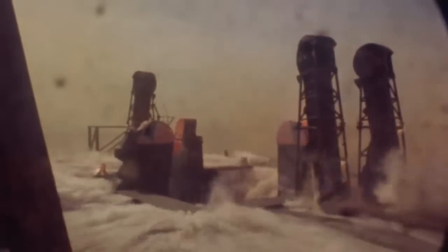You see that white ablative material really burning now, including on the tower. The water deluge system is full on. At this point the vehicle would have cleared the tower, but the exhaust from those five F1 engines was long enough to still be impinging on the launch pad. All of the white area you see is flame from that char material. There's an enormous amount of water being poured into the flame trench, plus nozzles on the base of the mobile launcher dumping water directly onto it, and additional water coming from above to shield the tower.